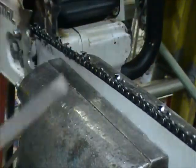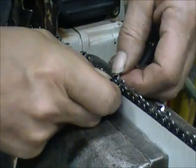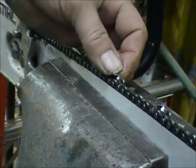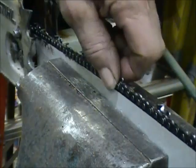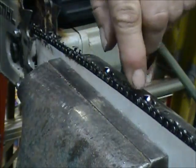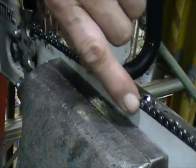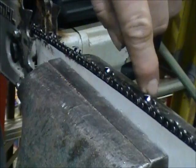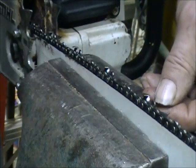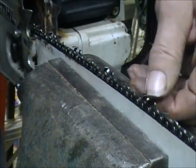A lot of people don't realize this: when the cutter is cutting wood, the top edge of the cutter will catch a piece of wood, kick backwards, and lean backwards — the front actually pulls up from the bar. If the cutter is new and the cutting edge is way out in front of the back heel of this link, the cutter will actually raise up. But the more you file this back, the less lift you get in the cutter. Because of that less lift, you have to have a lower depth gauge setting for a chain that's been ground back further than when the chain is new.